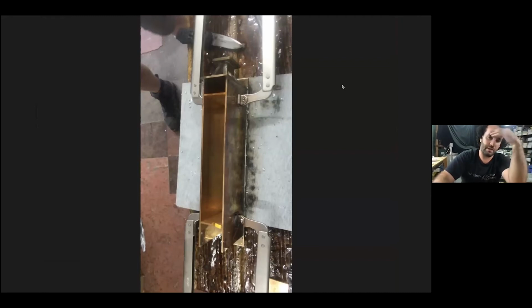And oh, here is the waveguide end piece. As we were soldering it, this was like a two-man job. We needed to hold it from all different angles. Soldering it was using two torches. We had two torches going in an X formation in order to heat up the copper. Copper is such a good conductor of heat that you really got to heat the whole thing up for a while in order to get solder to run on thick. That's like quarter-inch plate copper there.